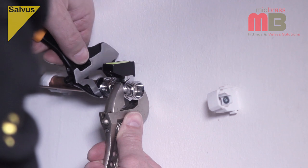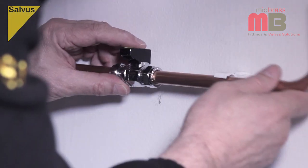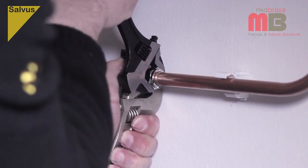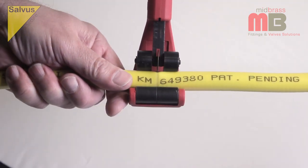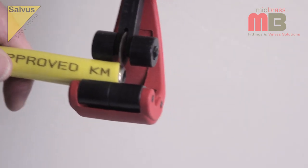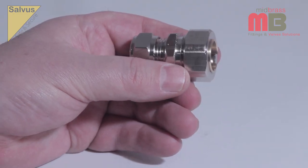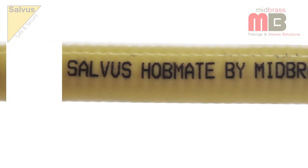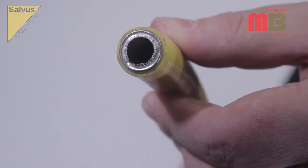Section 4: Install the gas supply 15mm isolation valve in a convenient location on gas supply pipework. Cut the Hobmate to the desired length for connecting to the pipework downstream of the 15mm gas isolation valve, minus approximately 25mm to allow for the G-Fit coupler. The cut should be made between two corrugations and can be made with a proprietary wheelhead pipe cutter, applying light pressure between turns. Ensure all burrs are removed after cutting.